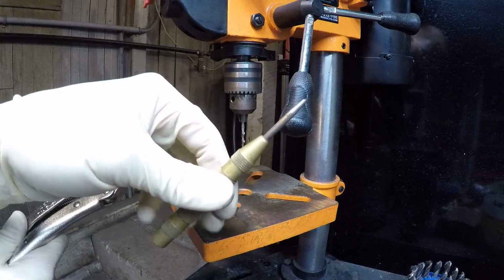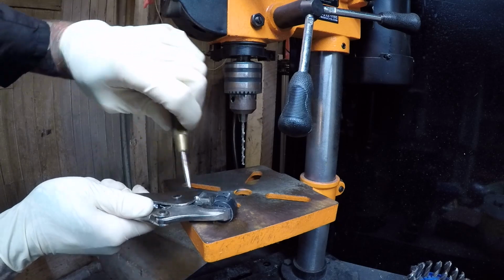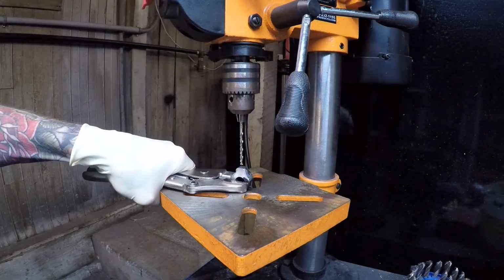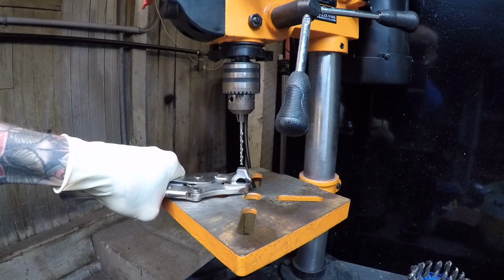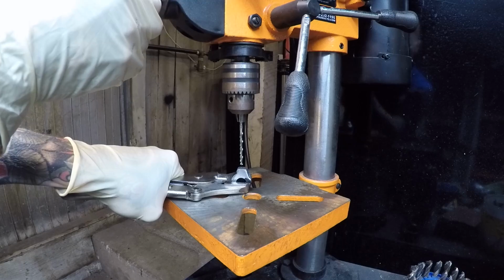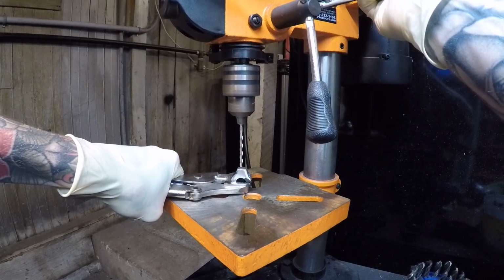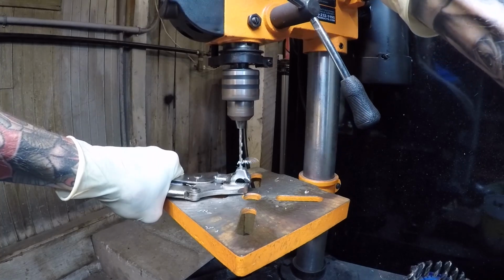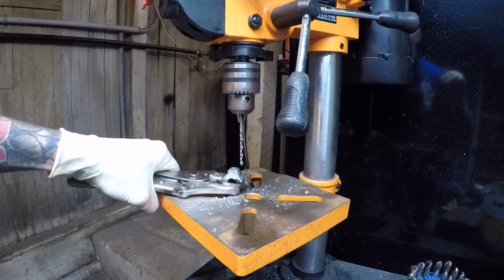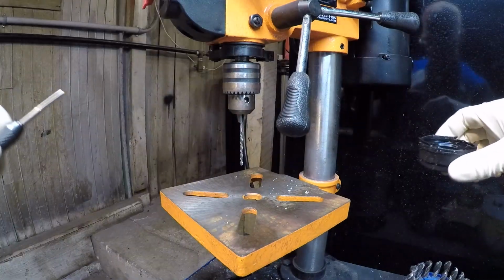A center punch is a great tool to guide the drill bit initially. Once you are marked and ready to go, try to hold or mount your handle base as straight and level as possible. Carefully drill into the center until the bit goes all the way through. Hopefully you drilled the hole straight enough. Too late now. So hey, grab your tap and thread that thing.